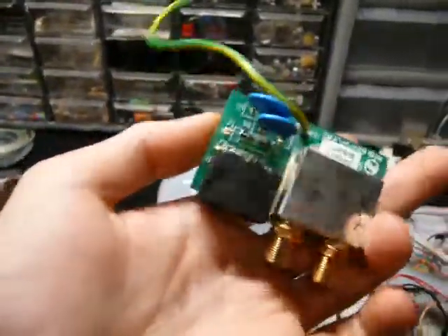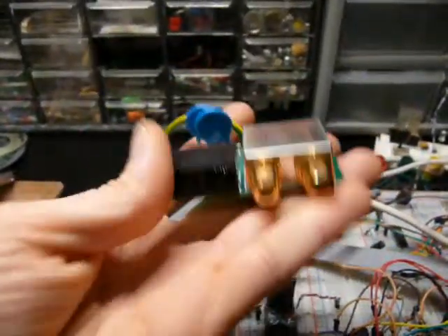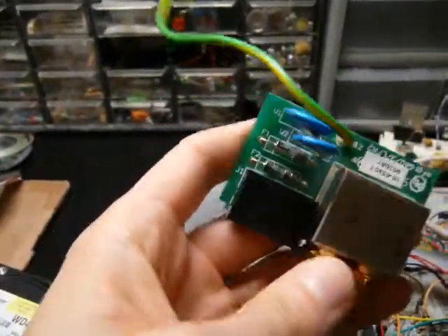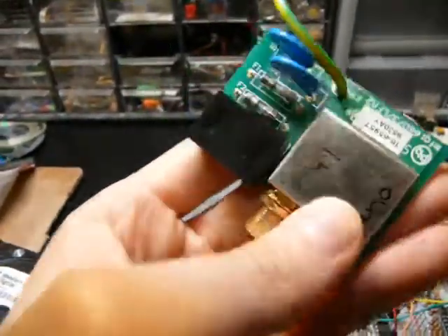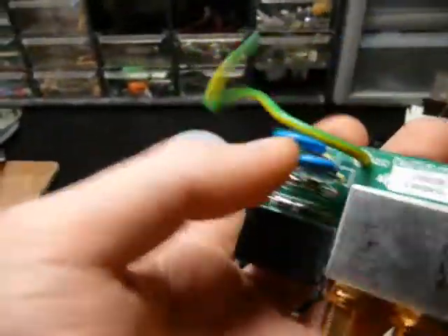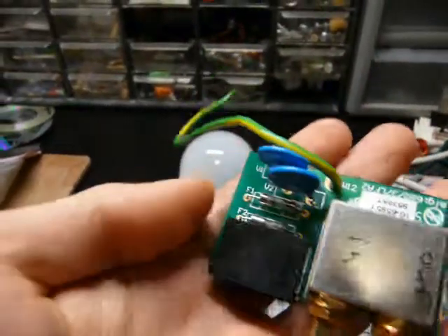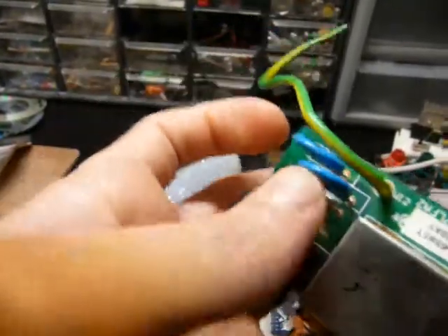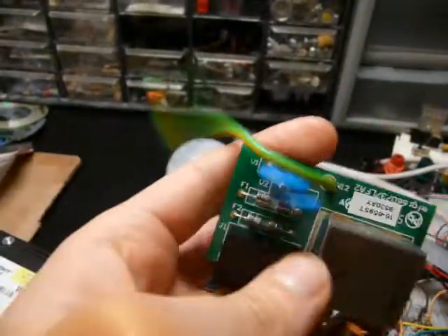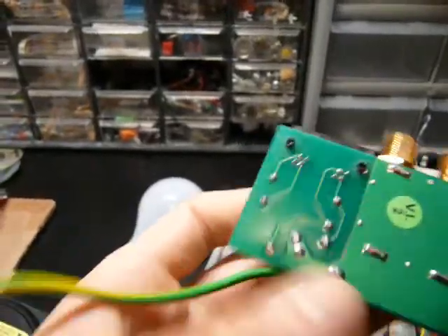So if you're wondering how this thing works, it's actually quite simple. Keep in mind that both halves of this thing - the cable part and the phone line part - are pretty much exactly the same internally. This one's a bit fancier because of its requirement to deal with radio frequency stuff. We'll just look at the simple one that we can actually see inside of. The key to all this are these two devices here, these blue ones - they're called metal oxide varistors. Basically, they do nothing - they're essentially an open circuit at low voltage. But as soon as the voltage increases above a specific threshold, specific to each device, they become essentially a short circuit. You can use that to help limit the damaging effects of surges.